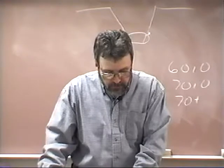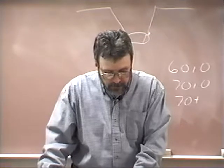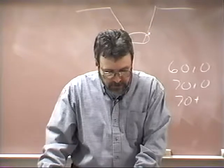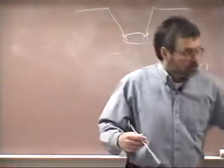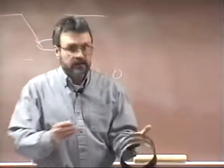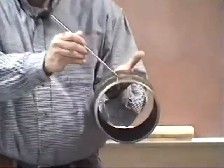He must watch the formation of the bead to see that the edges are well filled with deposited weld metal. In this step, he has the assistance of the higher current flow, which burns out the slag and promotes edge fusion. So as we're coming around this now, like so, we've got our proper rod angle.